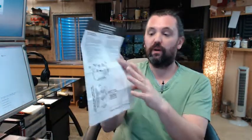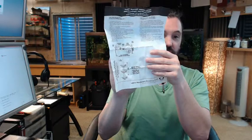Okay, so you can cut it out and then get that onto your template with this to the jamb or to what they call the Z-bar, and it's really a stop. I mean, it's very likely that your frame will have a stop on it in your storm door. Most that I've ever seen do. So with the door in the closed position, place backside of template on inside of door. So what they're meaning is, fold it up, put this on the door. At a height to miss any other hardware that you've got going there. So don't install it so that it's going to conflict with anything.